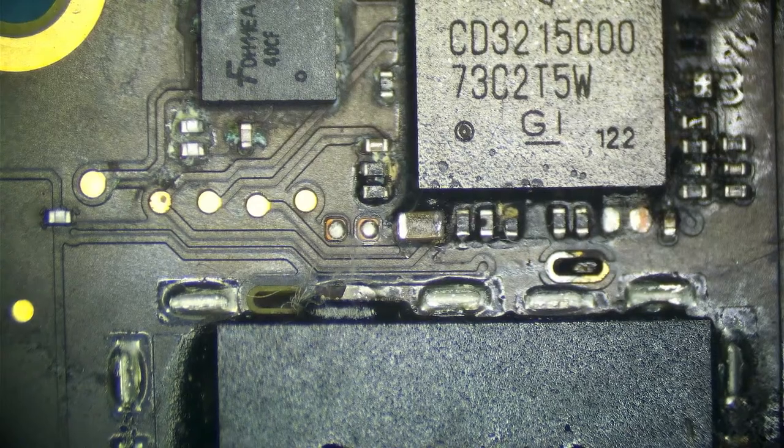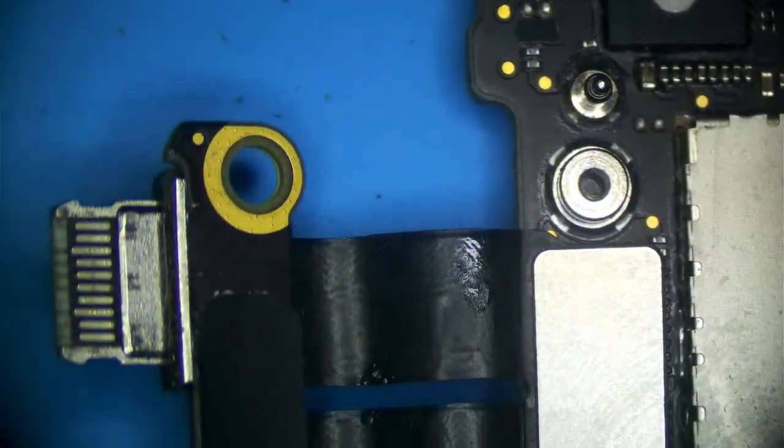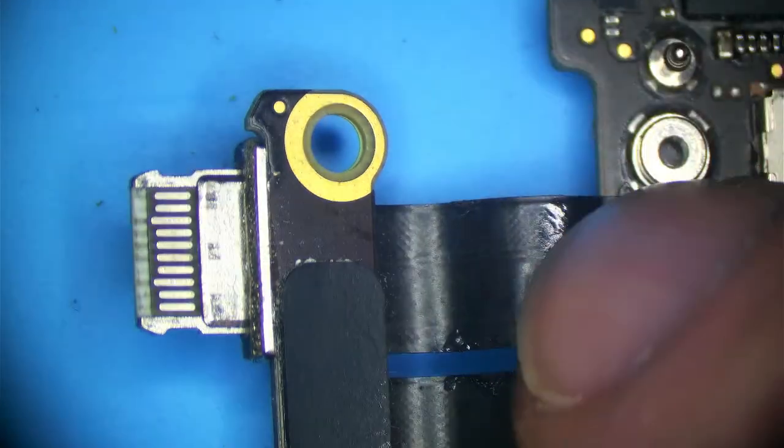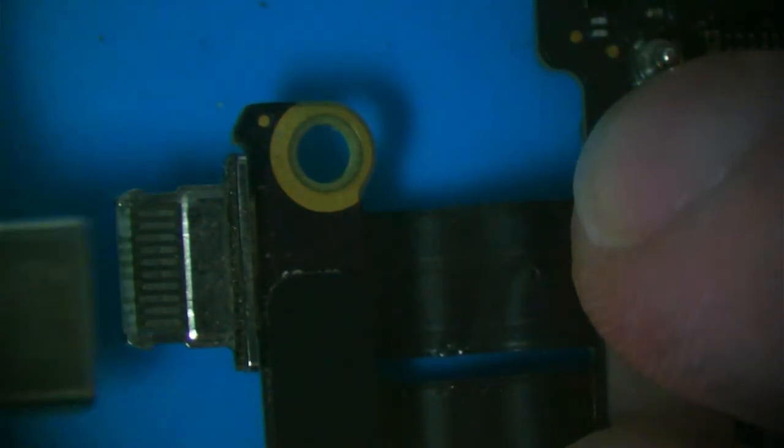Again, I must reiterate, this is a data recovery case. This device is probably never going to be used as a device again because the enclosure is absolutely trashed, and being an A1706, it's probably beyond economical repair. So, let's go ahead and plug this in now and see if we get any change in our symptom set by just knocking off the ugliest looking cap on the board.